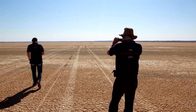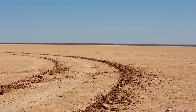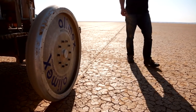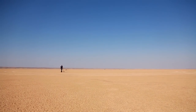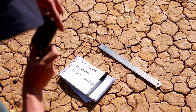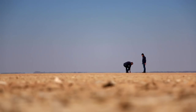It's really interesting looking at how the two wheels behave differently — we made them very different deliberately so we could see a clear difference. Now we've got the data from November and the data from these two wheels, we'll be able to design the optimum profile for the first year of running. When we start running the actual car, we'll learn an awful lot more about how the wheels behave, but this is the first major hurdle you've got to get over in designing an actual profile.